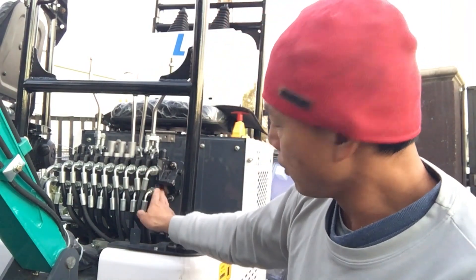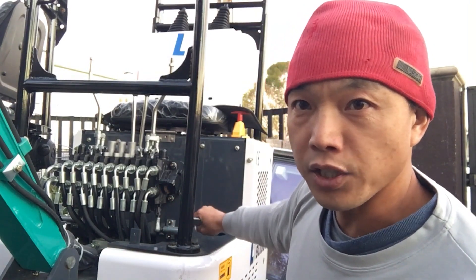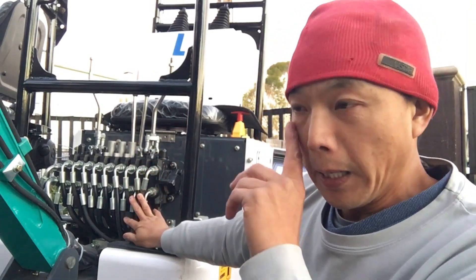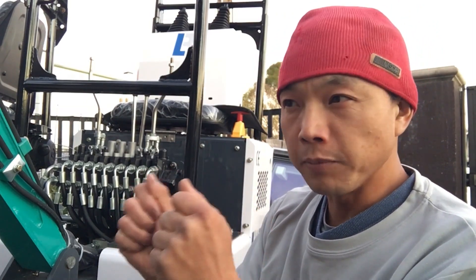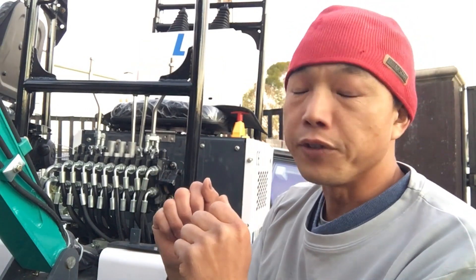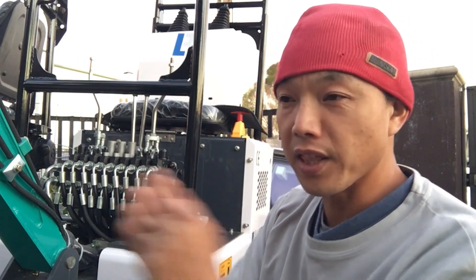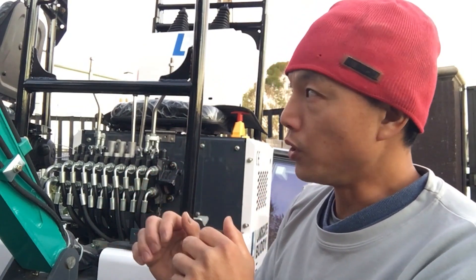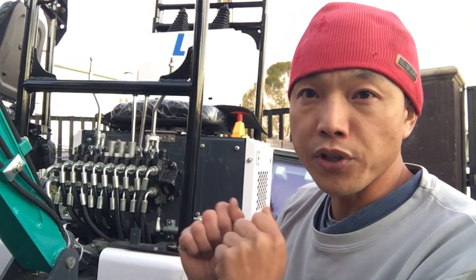This valve here has the actuator on the bottom and it's controlled by the foot pedal. With these manual directional valves it's tricky because you have to get that right movement in order to operate the excavator smoothly. In a lot of YouTube videos when people first get one, they move the handle and the machine jerks — that's exactly the reason, they're not used to it yet. In a little bit I'm going to demonstrate how you can get very smooth operation out of it.